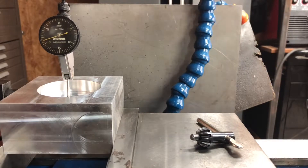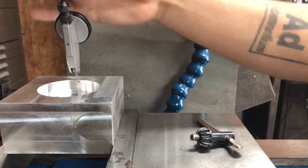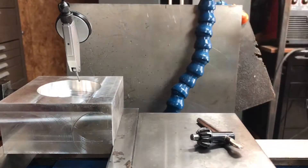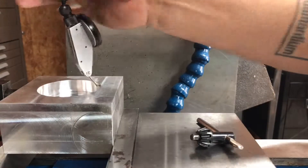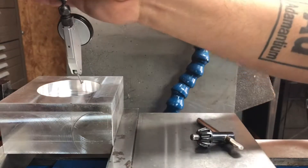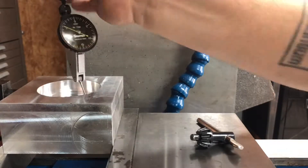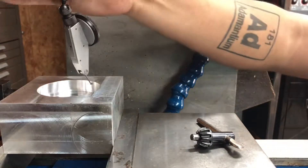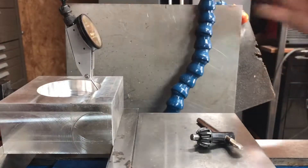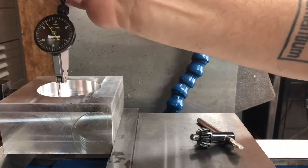So your indicator is not way off center. I know I'm touching on one side and not touching on the other, so I move the indicator over with the swivel. If it's bottoming out on one side, I move the table over until I get some contact all the way around. I do three sides first, considering that the hole should be truly round — if you do three sides, your fourth side is going to come out right.